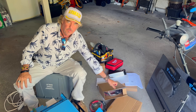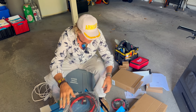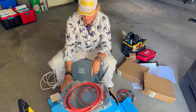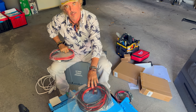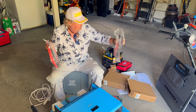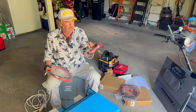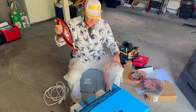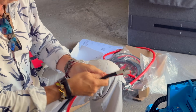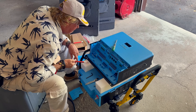These are the boxes of power cables they sent. We've got the main battery cables to connect the battery to the RV5, and then cables for the future connection from the RV5 to the e-panel. We'll set those aside for now. I've also got a set of MC4 extension cables for the solar panels so we can lay them out on the lawn, plug them in, and make sure everything's charging correctly. These cables have crimped connectors that screw directly into the battery terminals, so we just need to verify positive and negative — we'll need a set of allen keys.